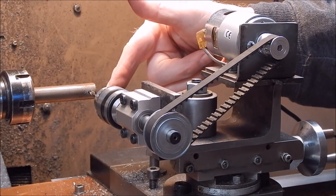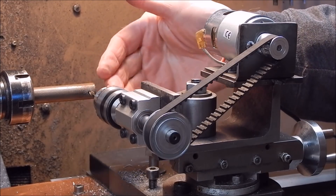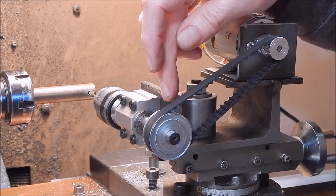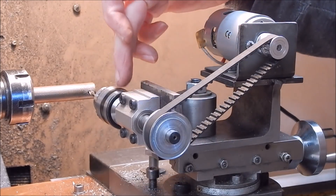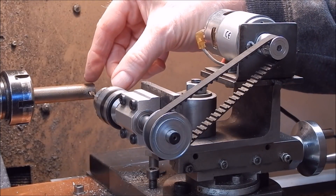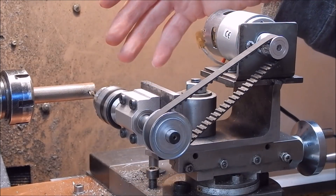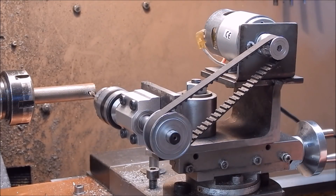Now we've switched to a 4.3mm drill. As the drills get bigger diameter they get longer, and this is where I've got to do a modification later — to move the mounting block back further, bring it back level with the end, and cut away some of the other bracket here so that the chuck will clear, so you can use longer drills. But at the moment I'm restricted to using stubby drills. I'll rework this, but at the moment I'll just be trying to see how it goes for power — is it worth modifying it and trying to use it for bigger drills? So yeah, we'll try it on this — 4.3, give it a go.